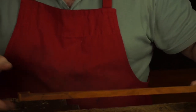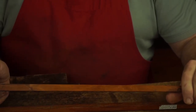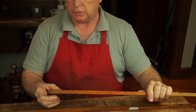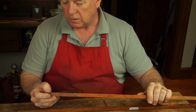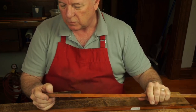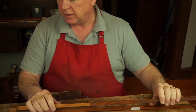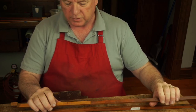And then they also put a notation here, so this bow is the specific gravity, so that's how dense the material is, 1.08, so it's heavier than water. And then it also has a notation on here, it's modulus of elasticity, so that's how stiff it is, and that is 3.96, so this is a pretty stiff bow. So we can make probably a very slender but yet still strong and supple bow. So this is going to be a lot of fun working with this piece of wood.